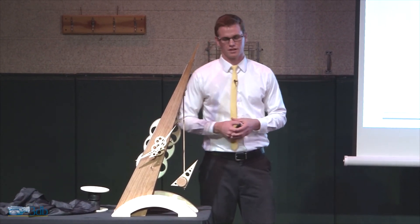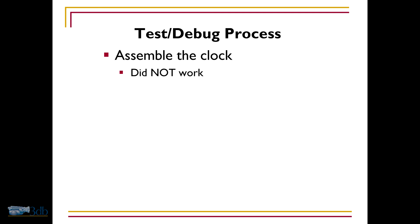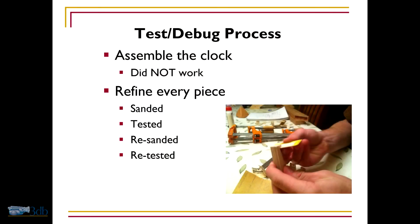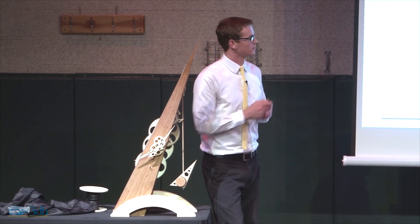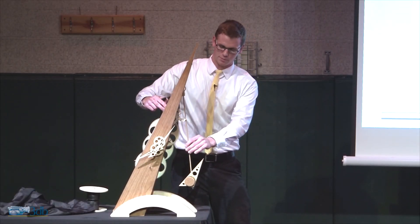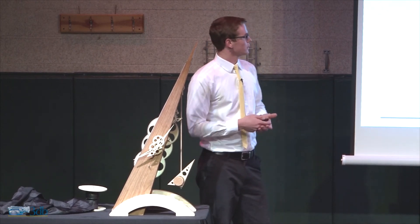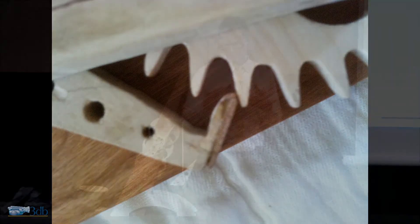Now that I had and understood the clock and had most of the pieces, I was able to assemble it. I assembled the whole clock and it did not work. So I had to take it apart many, many times and refine everything — re-put it together, re-test it, re-sand, and re-test. Through this process, I found that the escape wheel and the pallet were two of the main pieces that were really key in getting perfect. The pallet is connected to the pendulum through the pallet crutch arm. Whenever the pendulum swings out, the pallet piece goes into the escape wheel, and when it swings back, the escape wheel needs to spin exactly one tooth. The length is very, very precise, and I even added some hardwood to make it the right length, sanding everything to be very smooth.